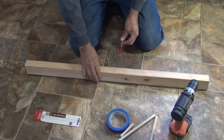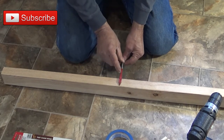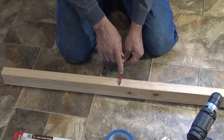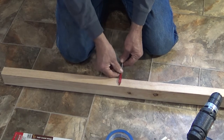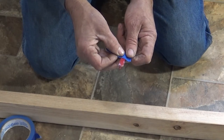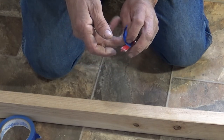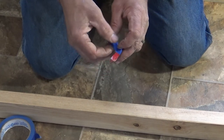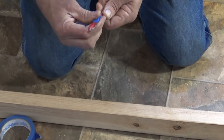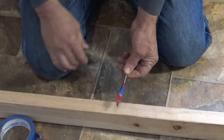We don't want to go all the way through the piece of wood, so I'm going to go to roughly about here. On the bit there's a mark — it says 7/16ths — and the hashtag between the two is basically where I want to stop. I'm going to grab my tape and creep it just above that mark, so if the tape decides to scoop back a little bit, it'll still be okay. The tape is going to tell me where to stop — when I'm drilling I'll drill until I hit right here, and that's where I'm going to stop. It's just a marker.